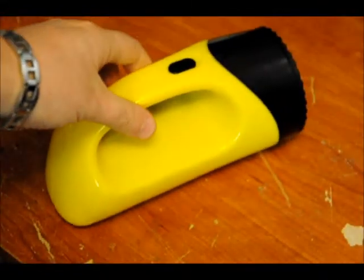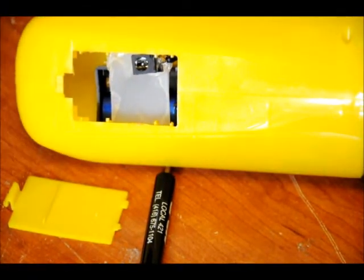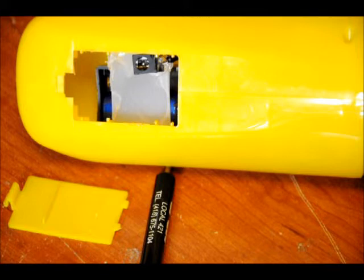This isn't even fully charged and it's pretty bright. I'll show you how it works. You take off the battery housing, and what we've got is a 5mm DC jack here. Two 50F 2.7V capacitors in the back there. We've got the switch actually on the front. We're using the default dollar store flashlight switch to turn it on and off, and there's also a resistor bank in there.